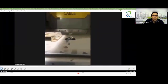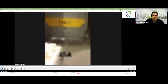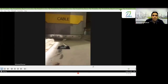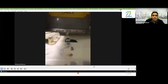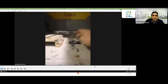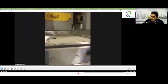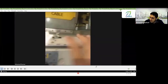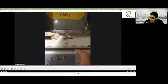The other thing is that you cannot move this knob to position H as long as the breaker is racked in. You must rack it out. After you rack the breaker out, even if you haven't closed the earth switch, as soon as you move the knob from position H to F, as you can see, the same lever moves. This means that this lever or lock can be activated in two cases: if you were going to close the earth switch, or if you move the circuit breaker from the free position to the hold position. This is the mechanical interlock that Engineer Ahmed was explaining to you.